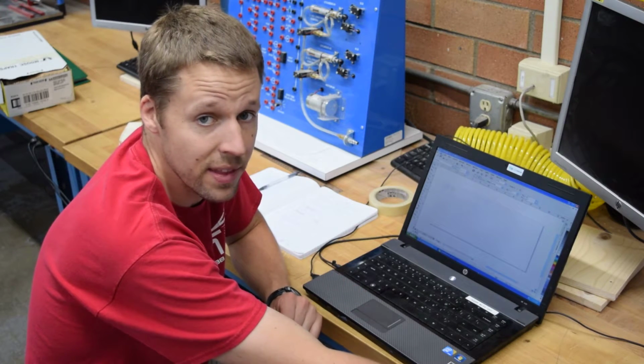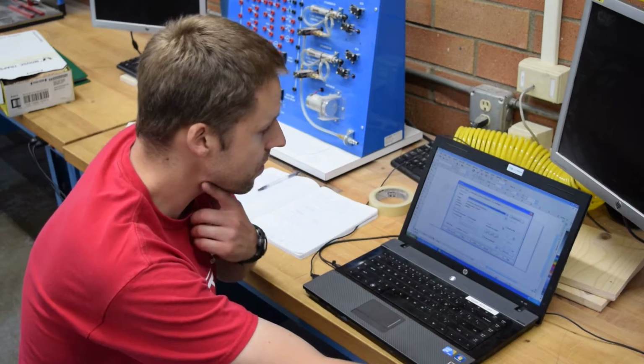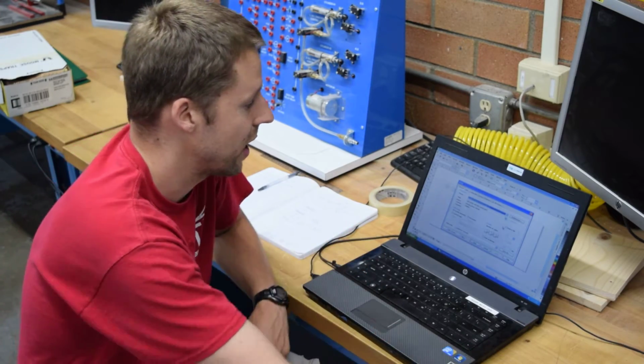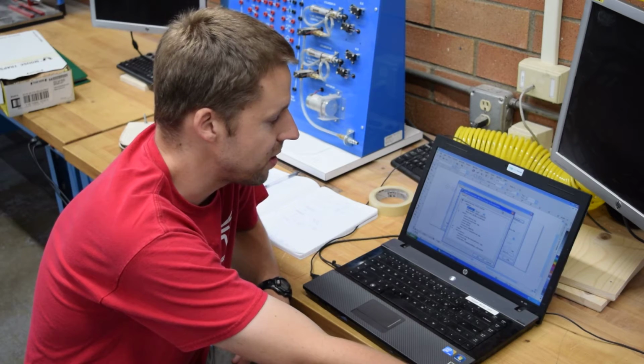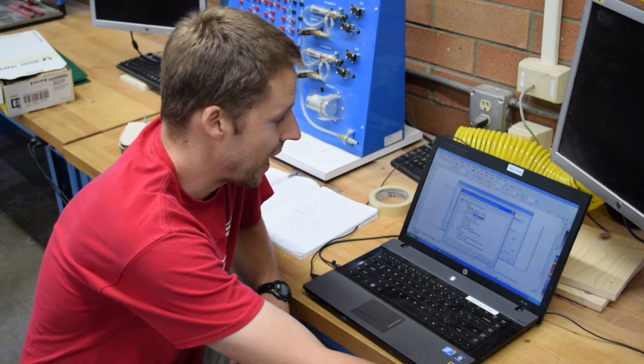Once I'm done with that, then I'm going to go to Print. So File, Print. And you have to set up the print settings for it to cut or for it to engrave. So before you print, select Preferences. And there are options for how you're going to be cutting this. There's one that says Vector. Vector is for cutting. There's another that says Raster. Raster is for engraving, which means burning into the wood, but not cutting through the wood so much.